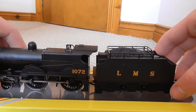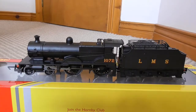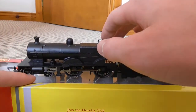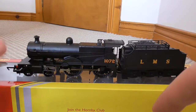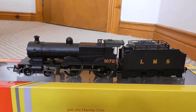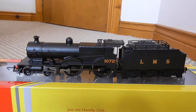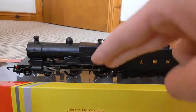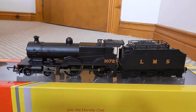Back to the 4-4-0 wheel arrangement - in case anybody doesn't know what 4-4-0 stands for: you would have four guiding wheels at the front, then four driving wheels - two on each side - and then no wheels behind the driving wheels. You can also get 4-4-2s, which would be four wheels at the front, four driving wheels, and then two trailing wheels. You can get 0-6-0s with no wheels at the front, six driving wheels, and no wheels at the back - and 0-4-0s as well. This is not how diesel locomotives are classified, but I'll get into that in a future video.